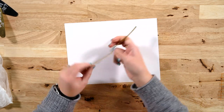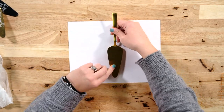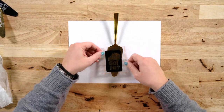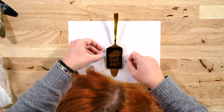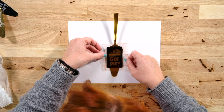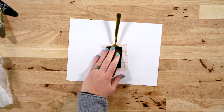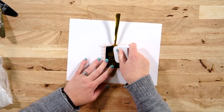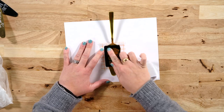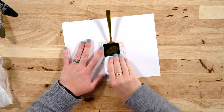One little hack I like to do: if you are trying to place your vinyl on something like this and you want it to lay down flat, put a piece of tape on the bottom and tape it down so it is good and flat. Then hover over it with your stencil — don't touch it yet. When you like the placement, lay it down and rub it really well with your fingers and a burnishing tool. You want to make sure that all of the stencil has adhered really, really well, because if it has not, the ferric chloride will get underneath the stencil and you won't have those really nice crisp lines.